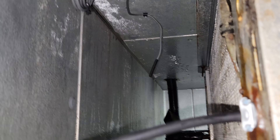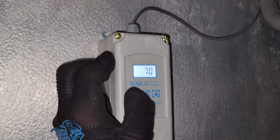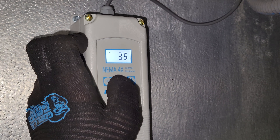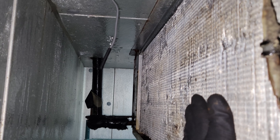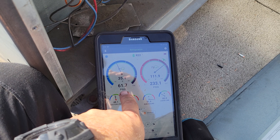Got it wired in. It's not perfect — temporarily put up there. We're going to set it for 37 with the 3. There we go, should be calling. This coil's trash — we're going to have to talk about replacing it. So this is just a temporary fix, really. Defrost clock's installed, we're all probed up.